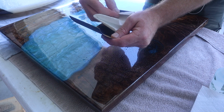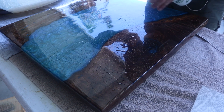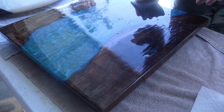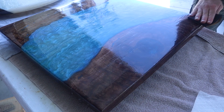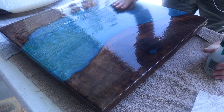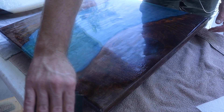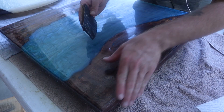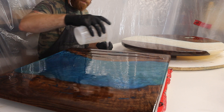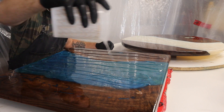Once that coat is done and cured, it's pretty much finished. I see a lot of people just let pieces go at this stage. I like to go over it with wet sanding paper and get all the little imperfections out, make it super smooth. If you hit it with a power sander at this stage, you'll burn through that top coat layer and end up back where you started. Doing it lightly by hand is always better. After wet sanding, dry it all off and hit it with a little steel wool to get all the dust off.